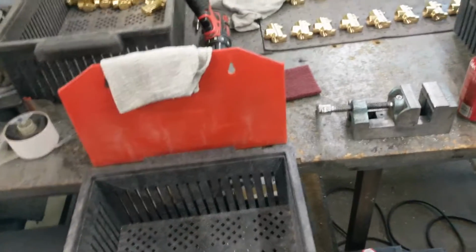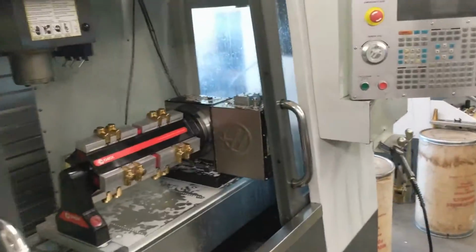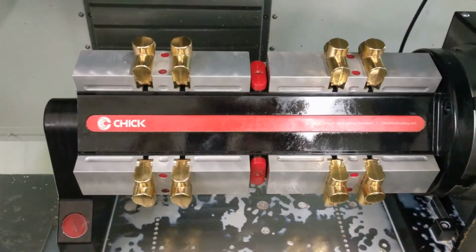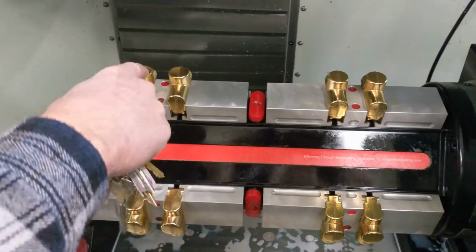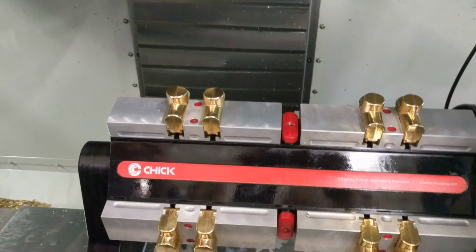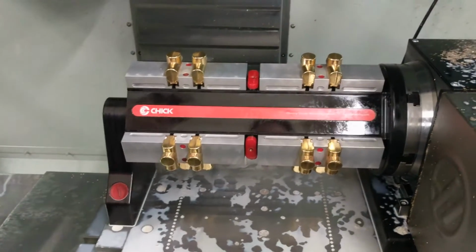Same story, we get a solid body in, and then we don't have a foundry, so we don't do solid parts. So this guy's doing what, 24 at a time here or something? What process is being done in this gadget? Well, this is going to do the bore and hog it all out first, then it'll do the real fine to the thousandths tapers, everything where the stem has to go in, so nobody's valve ever leaks. Every valve will leak eventually because no O-ring lasts forever.